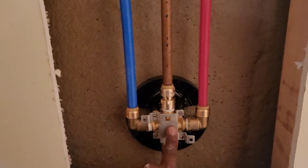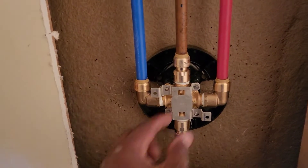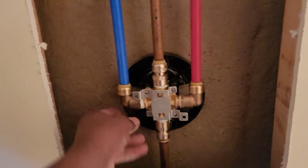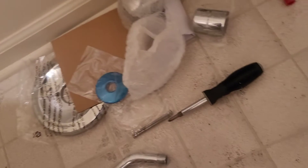All right, there we go — the new valve is in, flush against the shower insert. It's so solid I was going to put a brace on it but I really don't need one. Now you break this tab off, put the rings, and then the handle. Since I had the water off, no sense pressurizing the system just to test it when I could go ahead and swap out the leaky faucet for the single throw. So I'm going to install this before I pressurize the system.